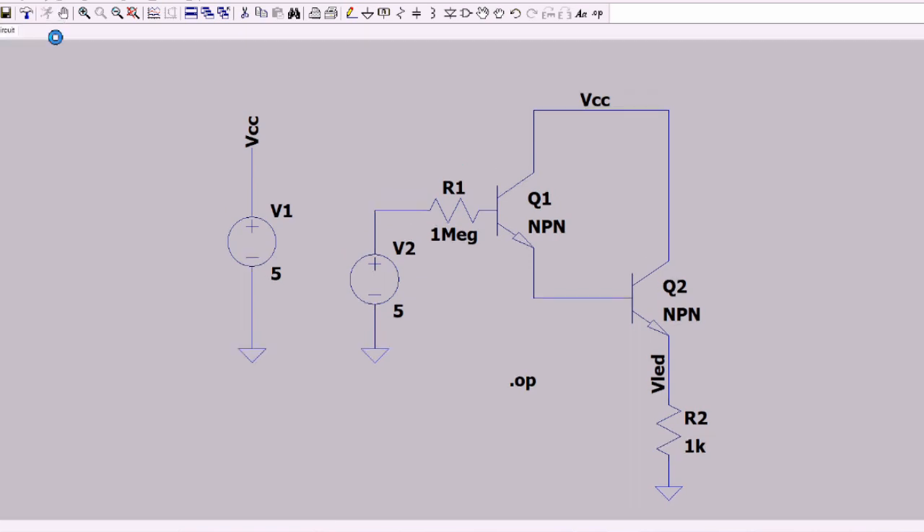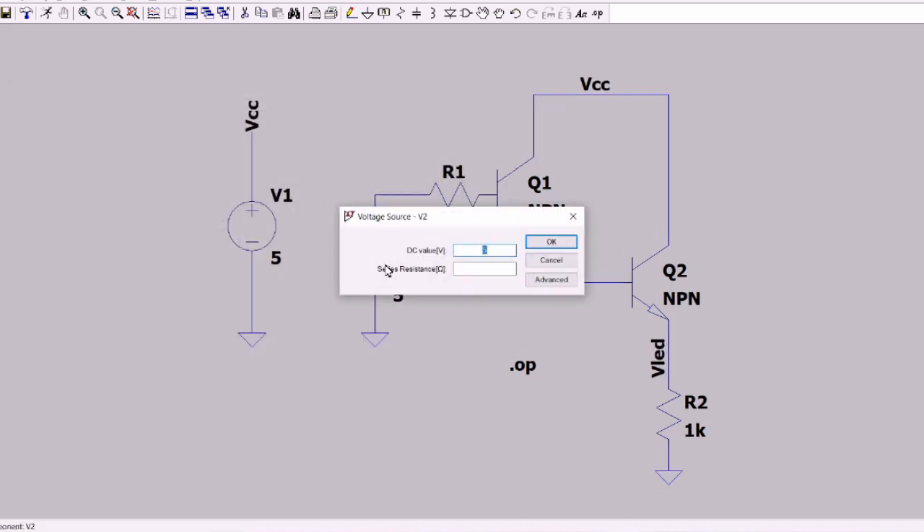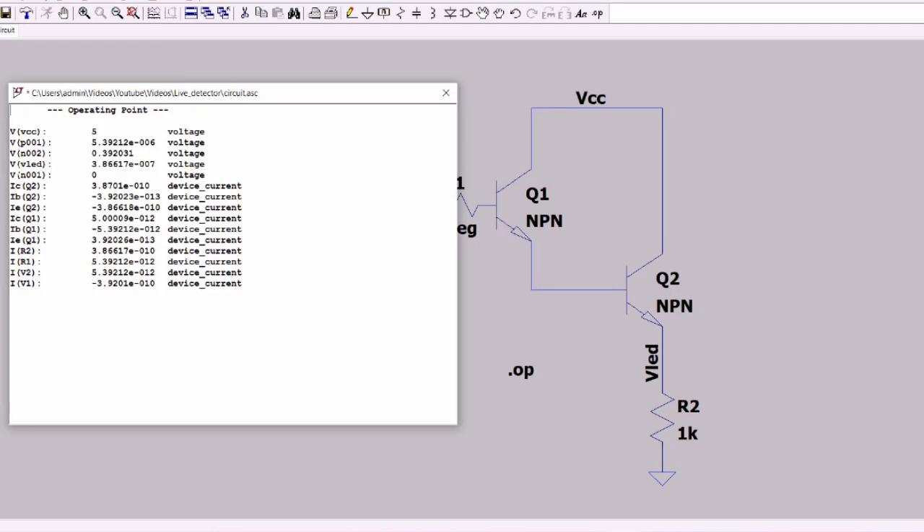As a good engineer I'm going to design this in LTSpice before I make the circuit in real life. Instead of using an LED I've used a 1 kilo-ohm resistor to represent the LED, mainly because I couldn't be bothered to set up the LED. The fancy values on the left are essentially just the operating point of this circuit. The highlighted voltage shows that when 300 nanoamps are applied to the first transistor, 3.2 volts are put across the resistor. Next I'll set the input voltage to zero, meaning there'll be no current into the first transistor. This causes a negligible voltage across the resistor, meaning that if there were an LED there it wouldn't be on.